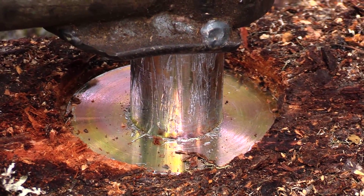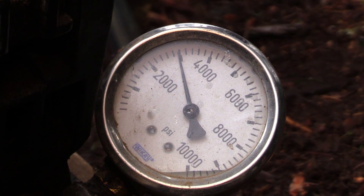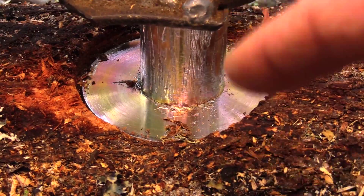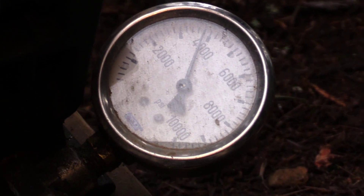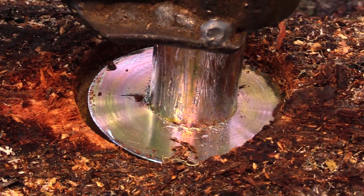Now we're going up to 2,000. We're at 3,500. We're starting to get a little separation — if you see this on your GLs after a winter or something, you know that you've gotten a big force on there. But it's still not failing yet, let's keep going. Now it's starting to move, we're right around 4,000. Now it's starting to fail — it's failing at 4,000 PSI. It just hit 4,500 and came back.